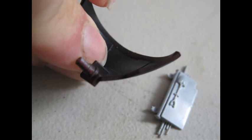Now, we're at a running disadvantage. Injection molded plastic or styrene is molded using heat in a single piece, so it's fairly consistent and strong in all areas. 3D printed pieces along the Z-axis are all these bonded blobs or lines of plastic on top of each other. So where those joins are between each layer, a lot like laminate or particle board, its weaknesses lie there, as well as other areas where it gets quite thin.